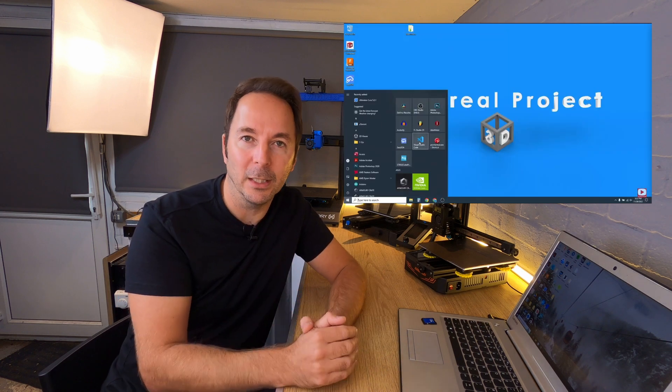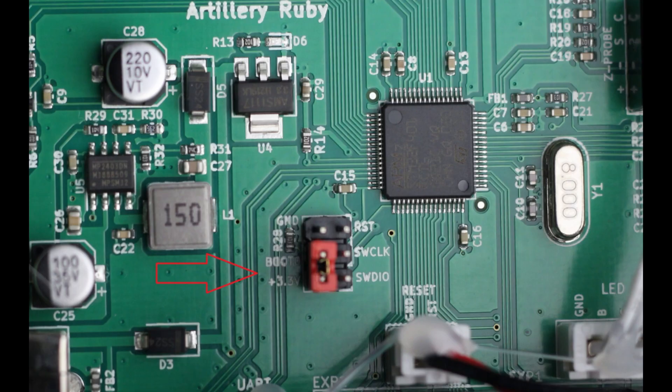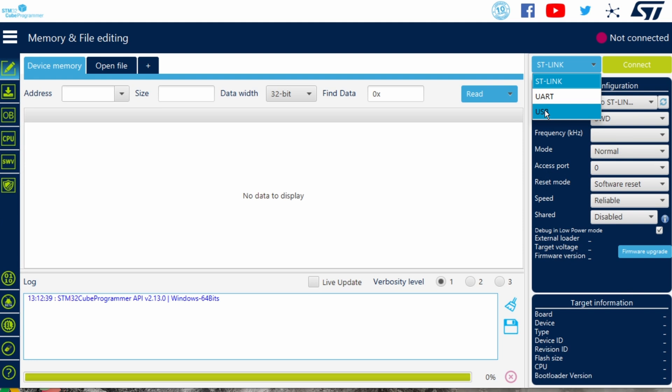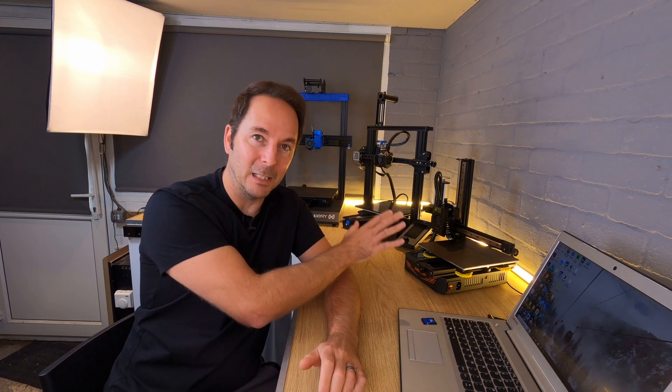The Sidewinder however is a different story. Its Ruby mainboard doesn't have something called a bootloader, which many other boards do, meaning we're going to have to jump through a few hoops. If you want to add Klipper control to your Sidewinder X2 I'll link to a great video guide that I found, but in basic terms, because of the lack of a bootloader you have to use a separate program or physically connect a couple of pins on the control board to put the machine into DFU mode. Then you need to use another separate program to upload the firmware to the machine through a USB cable. It's not that difficult when you find a good guide, but it is a very different process to some of these other machines.